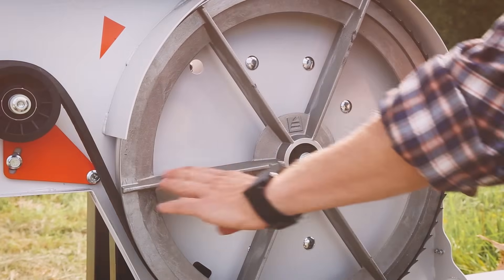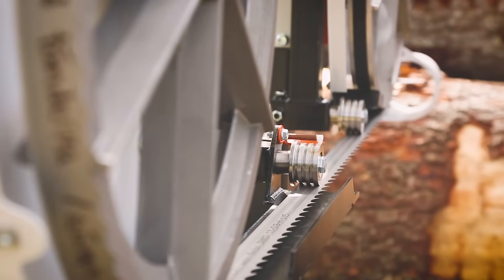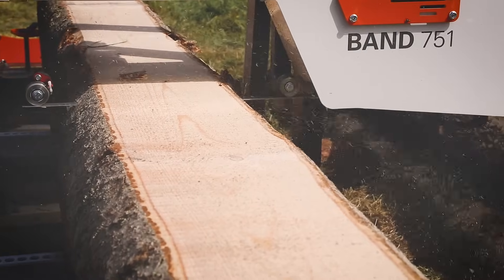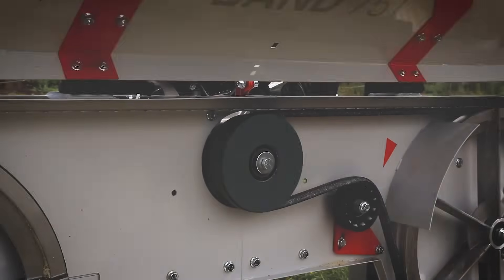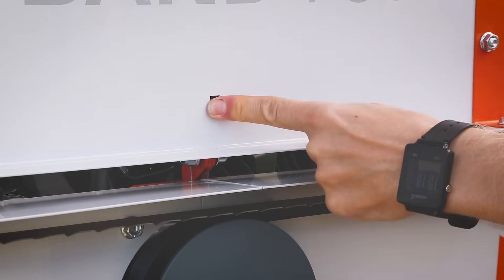The sawmill has a robust saw head with light metal band wheels measuring fully 50 centimeters in diameter. The band wheels have fan blades which blow sawdust away from the sawmill, while also keeping it clean inside the saw head. This facilitates blade changes and maintenance and service.